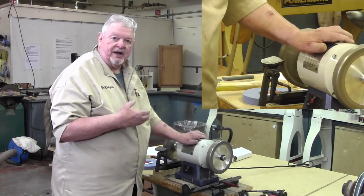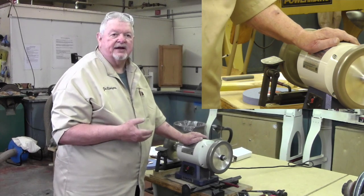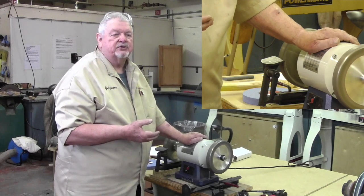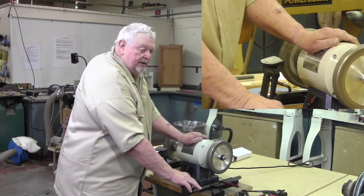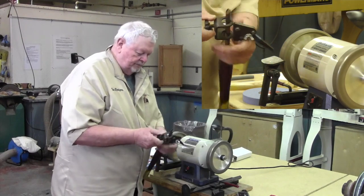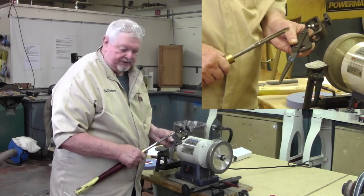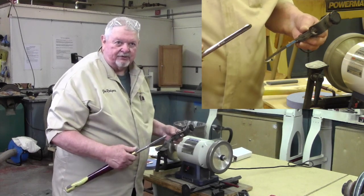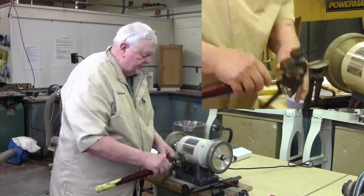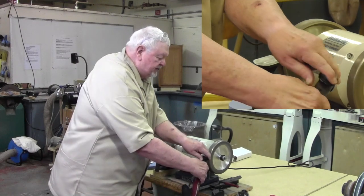There are a lot of variations in these different wheels — 80, 180, and on up in higher and higher grits. If you're a carver or need something super sharp, you might want to consider an even higher grit. For us woodturners, if I can repeat my settings, 180 is fine for bringing an edge back to my tool very, very rapidly. Because of that, I never adjust these settings. When I'm getting ready to sharpen, I put the tool into the fixture — this one is labeled 'bowl or deep-fluted gouge,' I have another labeled 'spindle or shallow-fluted gouge' — and I've never changed the length of this arm. Two inches is the arbitrary setting I have, so everything is repeatable.